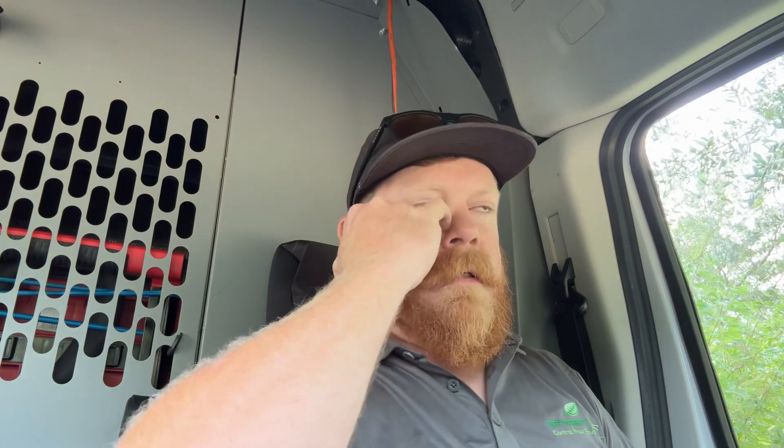So before doing a high pressure test, I checked myself with an electronic leak detector and I found the leak at the bottom left of that EVAP coil — usually where it always is, in those bottom corners. I sprayed soap and bubbles everywhere to verify; I couldn't get anything to bubble, so it's got to be up in that coil. Unfortunately it's out of warranty, so we're getting him a price and see what he wants to do. That's it — on to the next one.